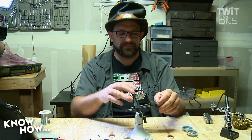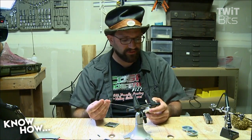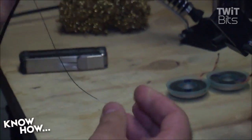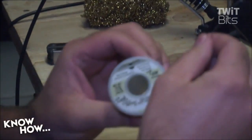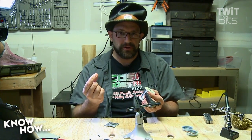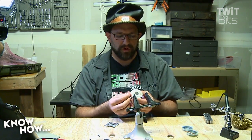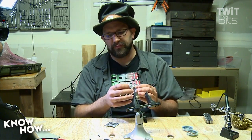Of course you're going to need solder. Solder comes in lots of different flavors, sizes, and types. This is a 60/40 - it's an old one and still has lead. Lead is getting harder to find. I like the finer solders because you can always add more solder if you should have used a thicker one, but if you've got a thick solder you can't use it where you need just a little bit. So I prefer the thinner solders, though thicker will work as well.